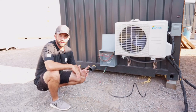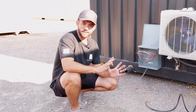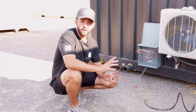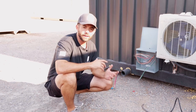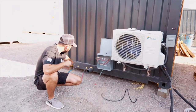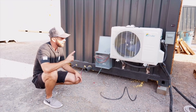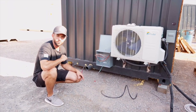After we get the 20-foot container, which is this one right here, stacked on top of the 40, the next thing is figuring out how to integrate the utilities from one unit to the other. In this instance, we have our 20-foot container here. We're going to discuss how we connect the water, power, and sewage, and we'll discuss HVAC as well between the two units. Right here we have our water line, our cold water line and our hot water line. It exits out the bottom of this 20-foot container and connects to the top of that 40-foot container, which I'll show you.